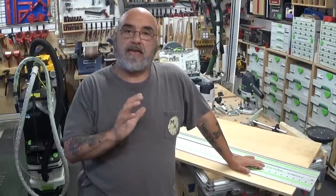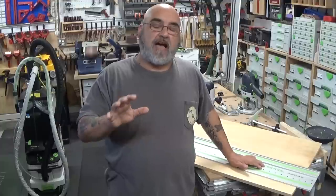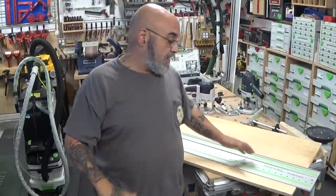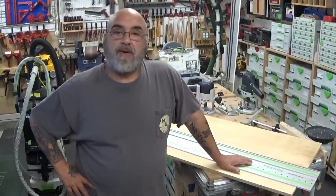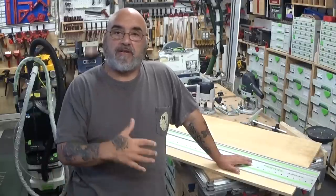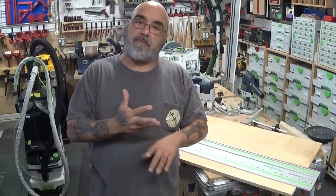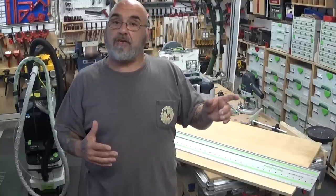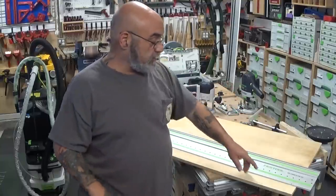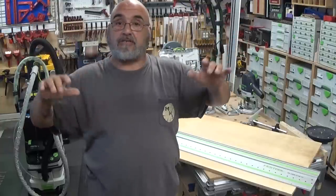All right, today I'm going to be doing a demonstration and an explanation on something that I get quite a bit of questions and comments on from past videos where I've used the system, and that's the LR32, and what I use the actual system for. On a lot of my past videos, you see me use it and did a quick demonstration to make the shelf pins. Now the system, besides the shelf pins, can be used to bore the cup holes for the European hinges, and now the new 500 domino connector system, by incorporating two 5mm, 3 or 4 5mm holes on the sides of the casework so that you can make the box with those removable pieces.